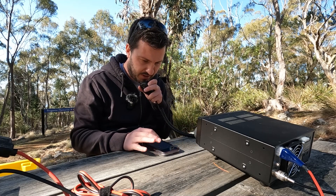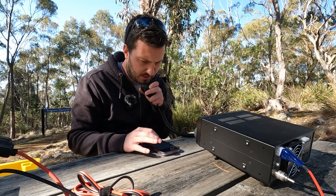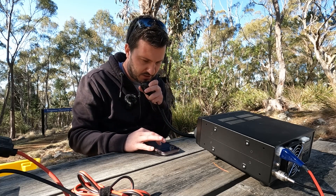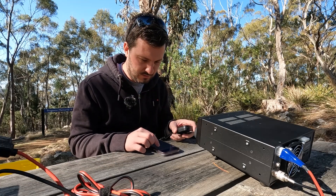QSL the 5x7, thanks very much Peter. I'm in VK dash 6406, just testing a new antenna out this morning. The antenna is one of Marty VK4KC's Mad Dog Coils — it's a 5 metre vertical whip with a loading coil at the bottom.